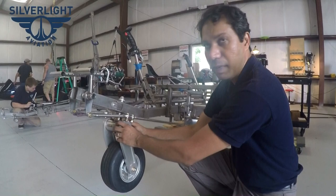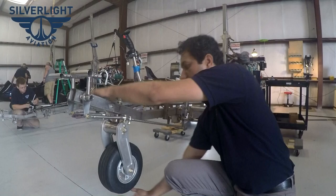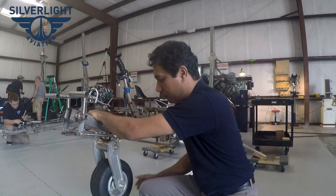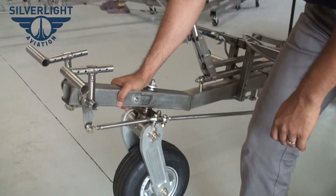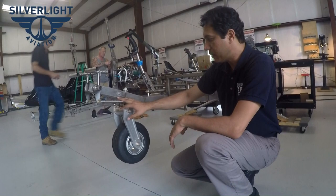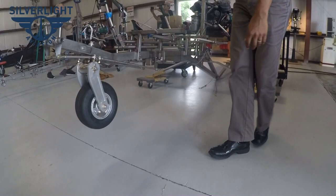The front wheel has suspension built into this round CNC stainless steel part. It has a spider coupling with hard urethane rubber that acts as suspension. Usually with your hand you should have hardly any give on it, but if you land on it, you'll see it actually has a decent amount of give. The peak shock load transferred up the spine is reduced quite a lot.